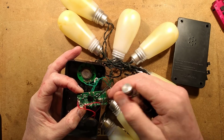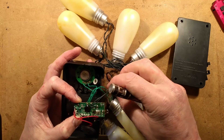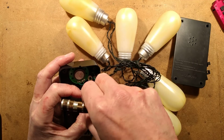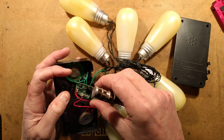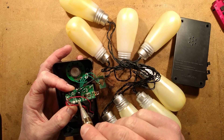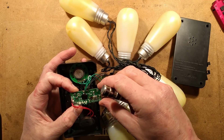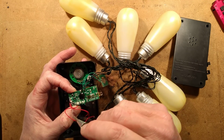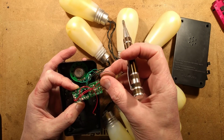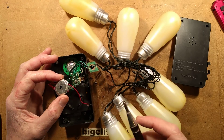There's a couple of transistors over here. One of them I'm guessing is driving the LEDs. Is the other one perhaps driving the speaker, or is the speaker being driven directly? The green wires are going straight to the chip. That transistor there looks like it's part of the sensing circuit - this is an audio sensing circuit. When it detects noise or vibration, that triggers it.